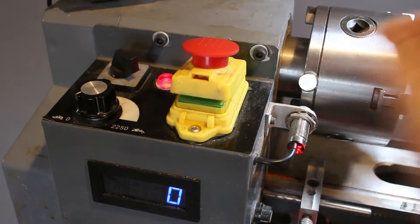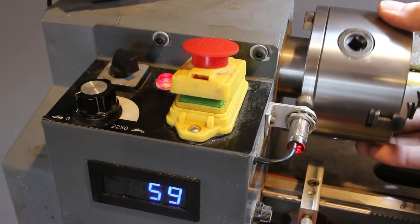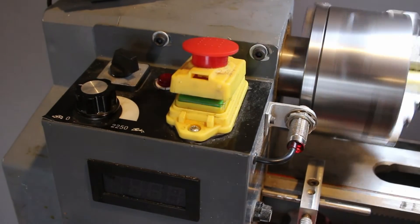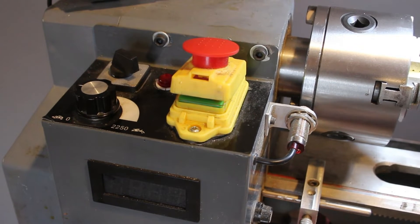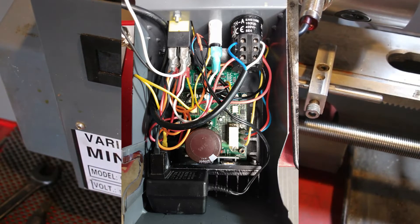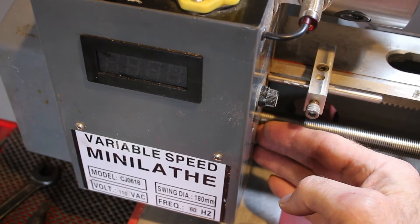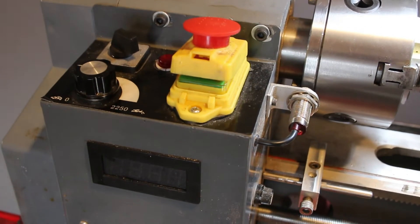If I turn this all the way off, you can see this light on the end, and you can see that it blinks very slightly every time this goes by. So let me leave that running. This is powered from a small wall wart — a little wall plug-in power supply — that I tucked in down at the bottom of the control box. There's quite a bit of room down in there. There's the drive circuitry right here, but behind it there's a place where I could put a little wall power module. Whenever this switch is pressed, it turns on the AC power to the whole machine and to the tachometer.